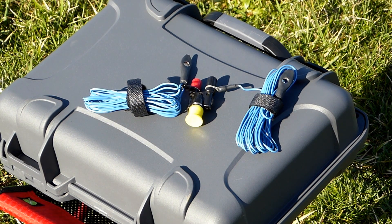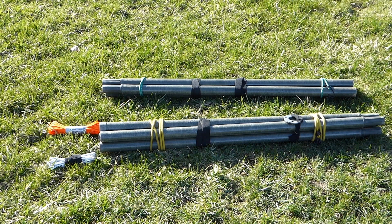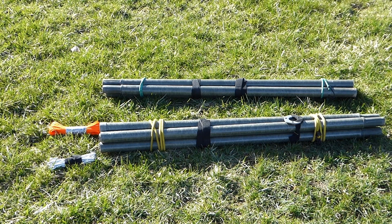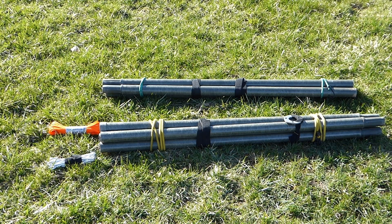This antenna looks perfect for use with the Yaesu FT-817, so today I'm going to use it without a feed line by directly connecting it to the front panel BNC female connector of that rig. I'm going to need a location where I have two high points to run the far ends of the antenna radials to, with the FT-817 situated roughly halfway between. I'll tie the far ends of the radials to some paracord for ease of installation. As a support system, I've brought along some military surplus poles. Trees would work just fine as supports, but I wanted to set this antenna up in the open so you could better see what it looks like when deployed. I will have the far ends of the radials up about 16 feet.